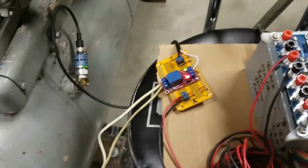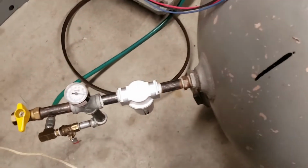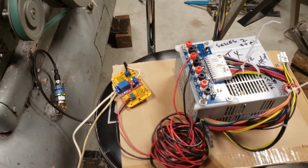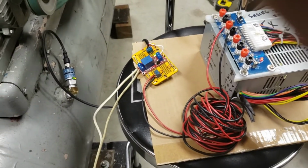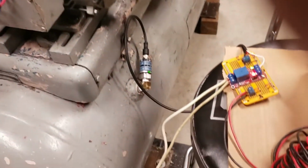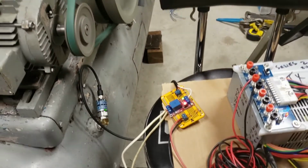This should work and solve that mystery. There we go. The yellow light came on the pressure switch. The motor is shutting down, and we are at pressure on the tank. So that's automatically shutting down. I can probably open the valve real quick and let the air out, and then it'll recycle real quick. Let's do that. And there it did. It just fired right back up again.